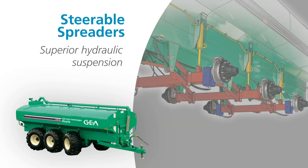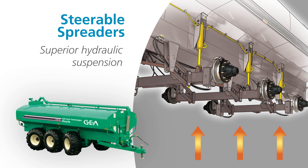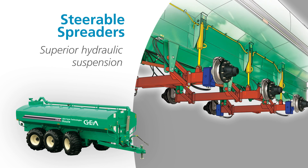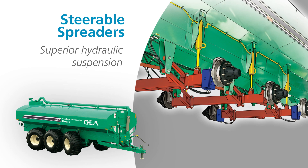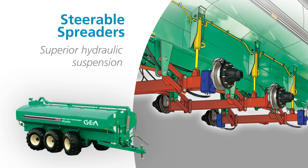Here's how it works. The axles shown in red are attached by four sway bars and one cross member, providing a stable base. Suspension cylinders shown in yellow distribute the weight of the spreader equally on all tires. Steerable axles with chromed kingpins shown in blue are mounted with greasable brass bushings, enabling you to maneuver through the toughest terrain. With suspension cylinders located close to the center of gravity, stress on the reservoir is reduced. When the spreader is full, this unique design reduces excessive load variations and improves tractor traction.